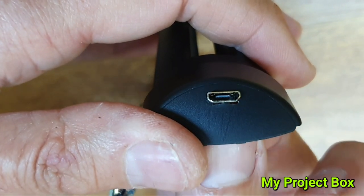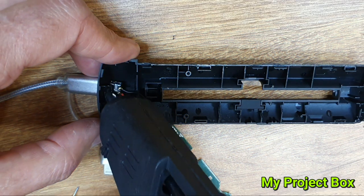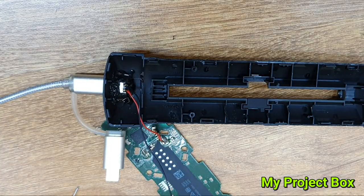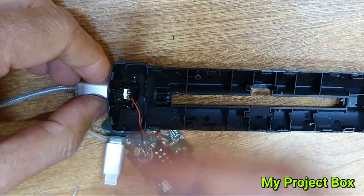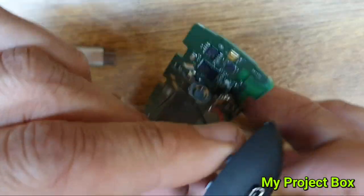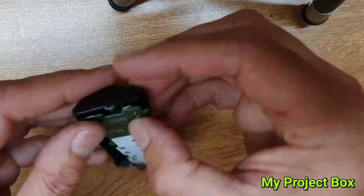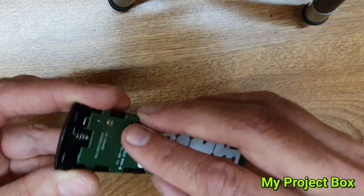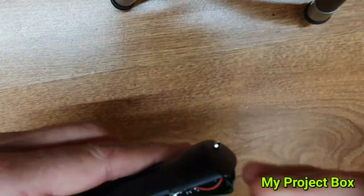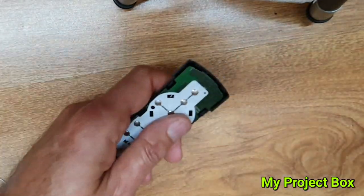The socket fits rather snug. Now we need to plug it into the USB socket to hold it in place, and then apply a whole bunch of hot melt glue around it — copious amounts, the more the better — and let that set. Then we can try to assemble the whole lot. Start by inserting the little metal cap on the spring terminal and carefully popping the spring terminal back into the board position. This can be very fiddly and the cables go all over the place, but with a bit of effort I managed to guide them with a screwdriver into the channel and get it all to click back together.